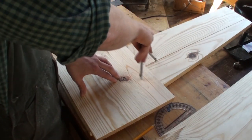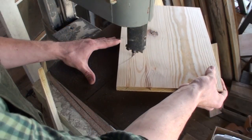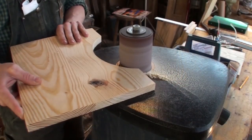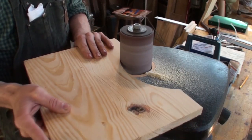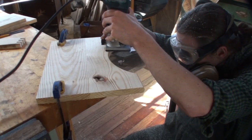These parts will make up the fronts of each one of the shelves. To reveal more of the covers, I marked and cut an arch into the tops of each one of the boards. The curves were then cut out using a bandsaw, and then I cleaned them up using my oscillating spindle sander. To soften the edges, I eased the corners with a one-quarter inch round-over bit.